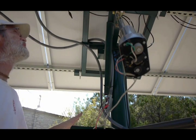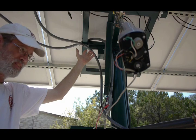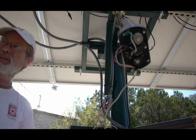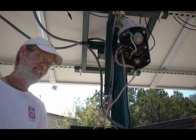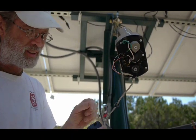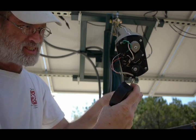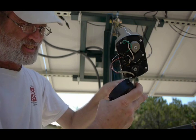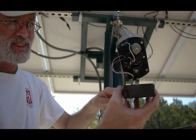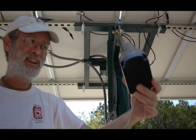It ran out one second and then back in, so I got the polarity right on the wires. And now after about 10 more seconds, it begins adjusting the tilt for the current solar position. And there we go. For reinstalling the motor cover, the grommet has this groove in it. I just slide that, put the cover on, with the flat part lining up with the housing, and everything's sealed up.